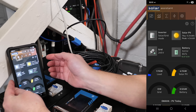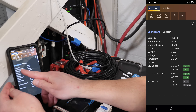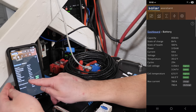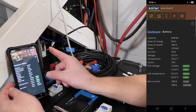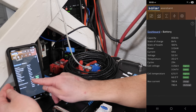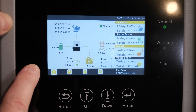We're sitting at 53.5 volts, 84% state of charge. Clicking through gives: battery capacity 858 amp hours, 84% state of charge, state of health 100%. The cycle count here is 294 — I've had these batteries longer than the EcoWorthy ones. Cell voltages are 3.356 high and 3.347 low, plus temperatures, and max current charge and discharge is equally rated at 780 amps.